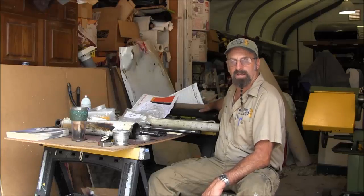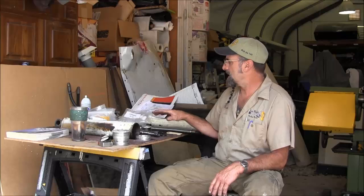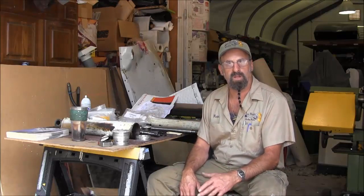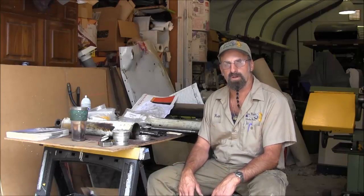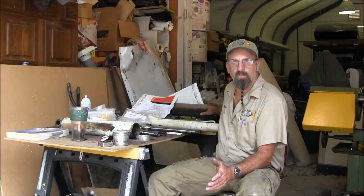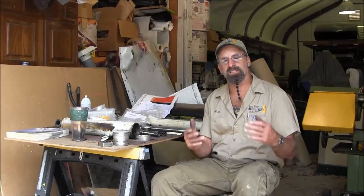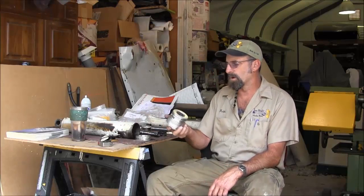This third cylinder is out of a wood splitter. Now, these are pretty simple. Clean them a little deeper, make sure that they are going back clean, put new seals in them, and we're good to go. The wood splitter had O-ring damage from welding the fitting on, and that created a leak after the fact. These here are just kind of worn.